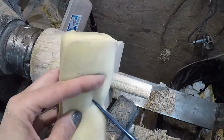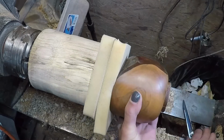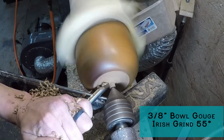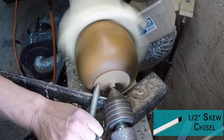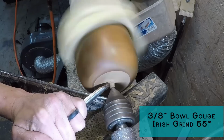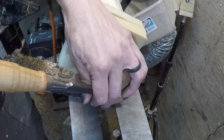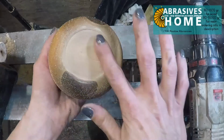I already had this jig that I made for another vessel at one point, taking the bottom off of it, and I grabbed some foam from a package that had, I think, some lathe parts in it, and just cut a hole in it and used that, because the top side is uneven bark, so that really helped get that nice and square on there and held it, and also did not damage the top of my piece at all. So that was wonderful. So save your foam, because you might end up having to use a jig similar to this one, and it really worked fantastically.